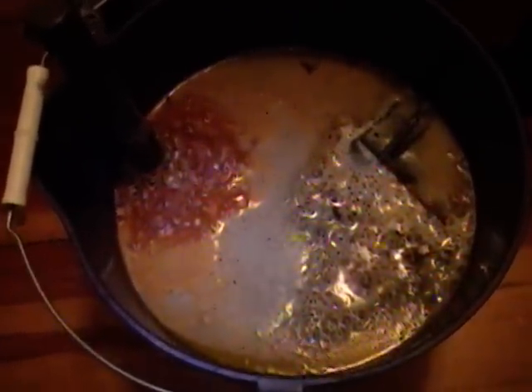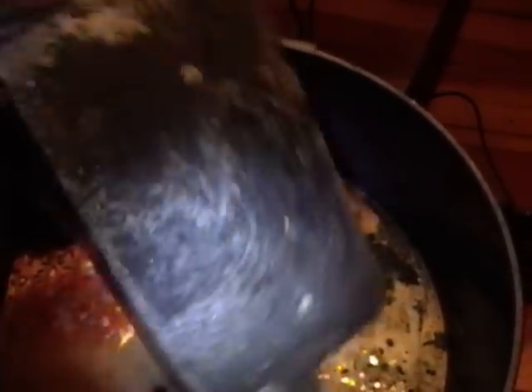It's been a couple of hours and as you can see I've got a bubbling mess here on the anode side — some rust-colored bubbles — and on the cathode side some whitish bubbles. I think it's time to pull this out, see how things are going, cut the power, and disconnect the lead. Things are looking pretty good. What happens is the rust actually kind of turns black — you need to rub it off with a paper towel, or if it's more deeply pitted, maybe a wire brush. I'm going to take this over to the sink and wash it off.